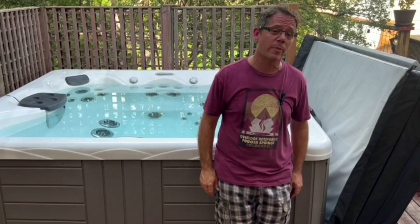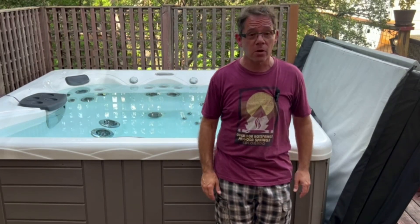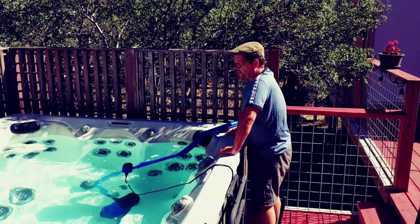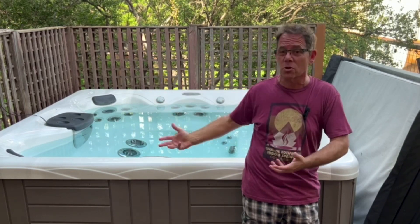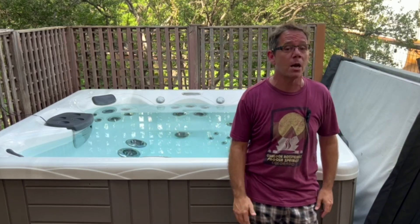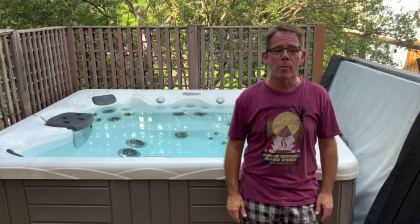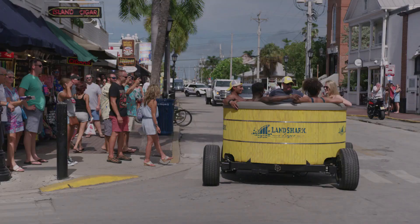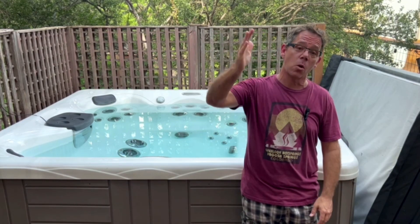The last thing I want to talk about to get your water to balance properly is not changing the water in your hot tub frequently enough. I change my hot tub water about every three months. If you rarely use your hot tub, you might get away with every six months. But I've talked to people who don't even change their hot tub water once a year — and that is crazy. Water that has been in your hot tub for a year is dirty. No amount of filtration, no amount of sanitizer is going to completely clear that up. Dirty old water is going to be much harder to balance correctly than fresh water from your garden hose. Change your water somewhere between every three and six months, depending on the number of people that use it and how often. And if you're struggling, always err on the lower side of that range.